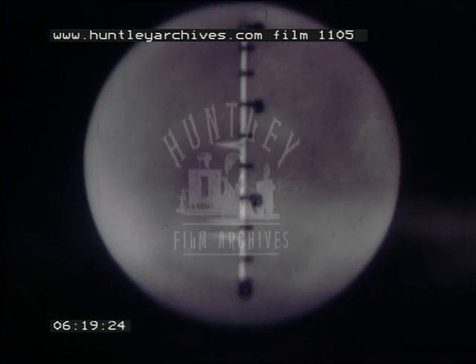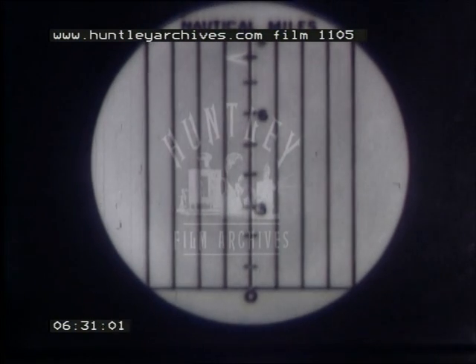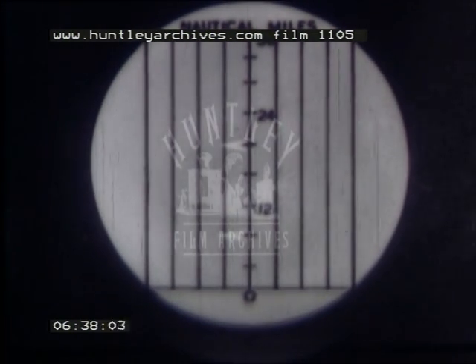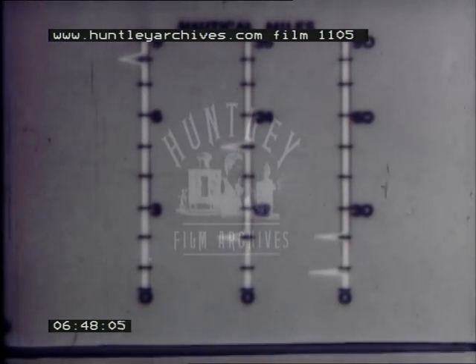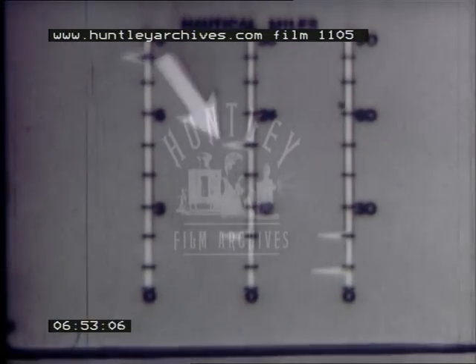But we want to find correctly the ranges of ships close to us, and at the same time spot ships a long way off. To do this, we have three different time bases which we can use. The first shows ships up to a distance of nine nautical miles, the second goes up to 36, and the third up to 90 nautical miles. Suppose there are two ships, one eight miles from us and the other 20. Then this is what their blips look like on the three different scales.